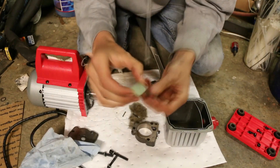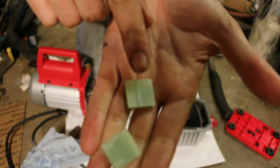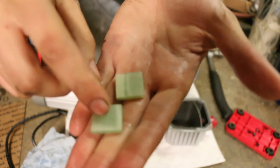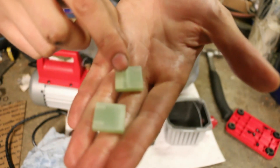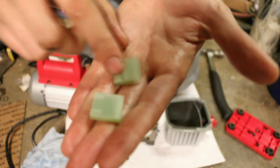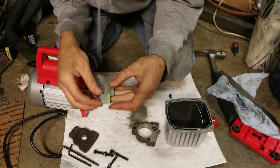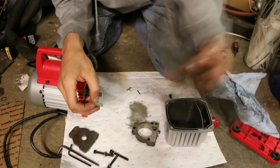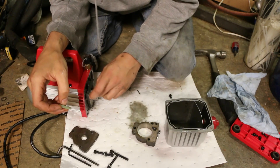Right here — I don't know if the camera will focus close enough — but you can see this discoloration right up here towards the end on this one. This one doesn't really have it; it just has discoloration from me hammering on it. But this darker patch is rough, so we're going to smooth that up and see if we can get this working again. I took each of these and smoothed them ever so slightly with a fairly fine but large metal file until they slide smoothly.